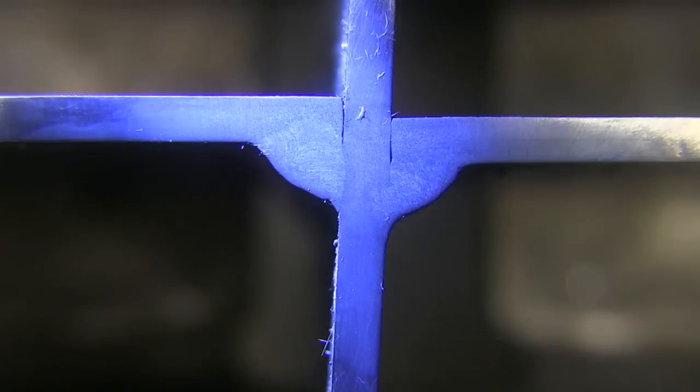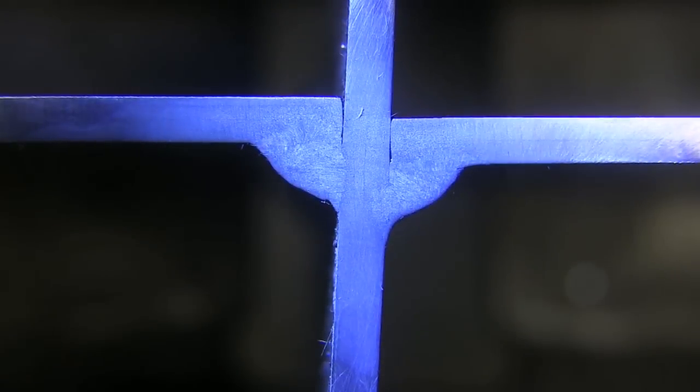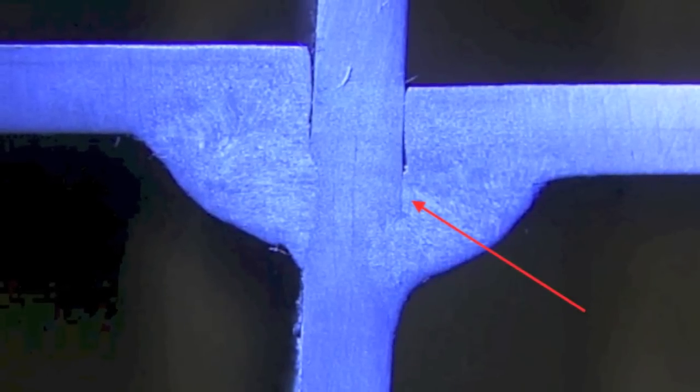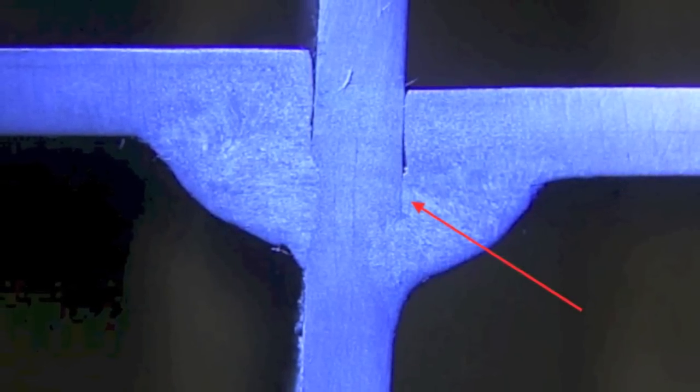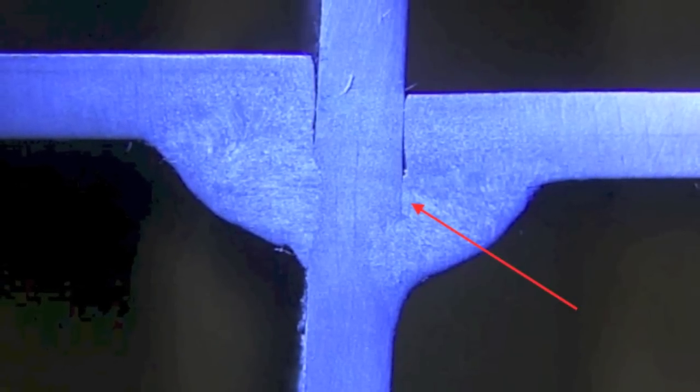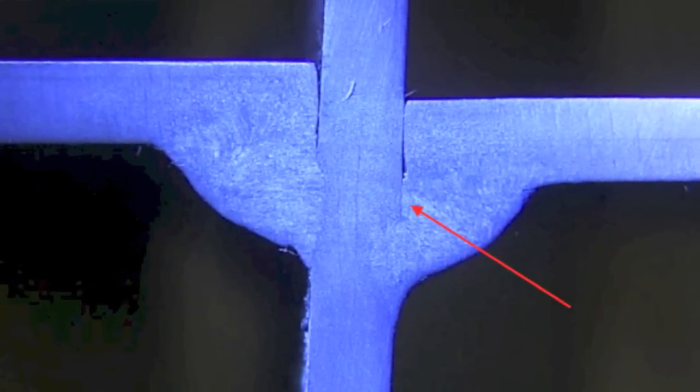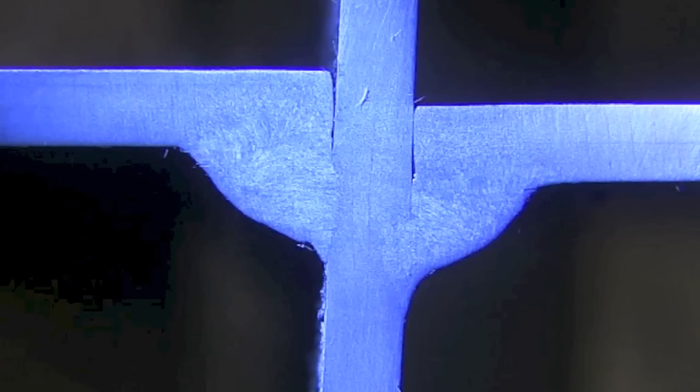I've got a little Q-tip with some of that passivation solution and it brings out the weld profile. A flashlight helps a lot — playing light from different angles. You can see where I've got the arrow pointed: that's the one with the low wire feed speed and there's a considerable amount of lack of fusion there. That straight line indicates lack of fusion. The one on the left was 280 inches a minute and got a really good penetration profile. Well, that does it for this week — thanks very much for watching, see you next time.